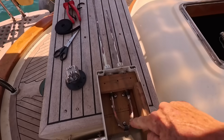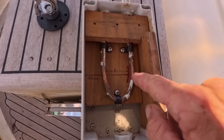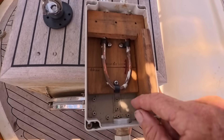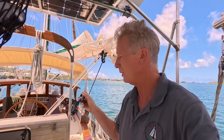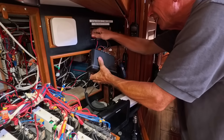I've cut the long one to the exact length it should be. This shorter one is a little bit longer so I can tune it by cutting some bits off. Actually I think the main tuning is done by where you connect the coax wires — the centre goes to this one and the outer to here. I'll just clamp them on and check the SWR meter to get it as close to one as possible by moving this one around, then bolt them on when ready. I'm going to use this Mantus clamp — I actually bought it to go on the binnacle to mount an iPad. It's a really good little design. I can just screw this onto the junction box and it'll hold it nicely. The VHF will be better off too because it now has its own aerial and doesn't have to go through a splitter.